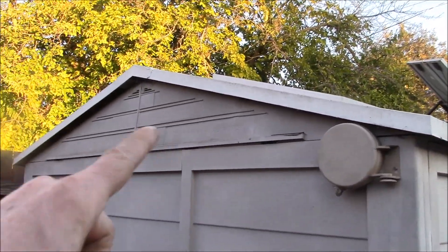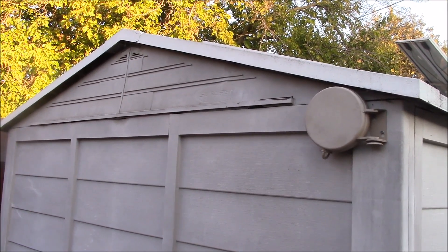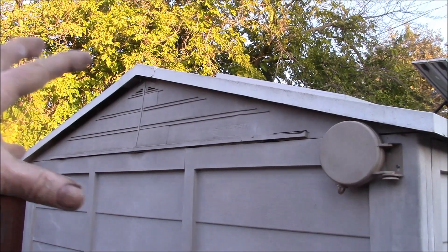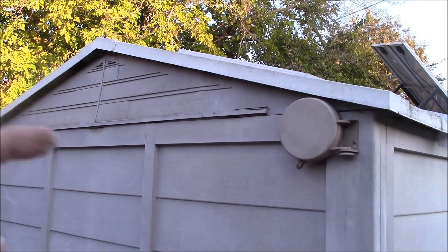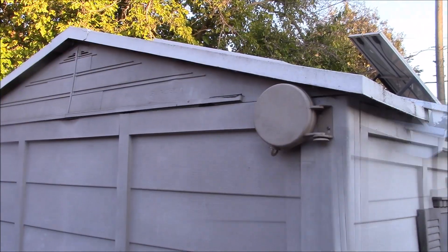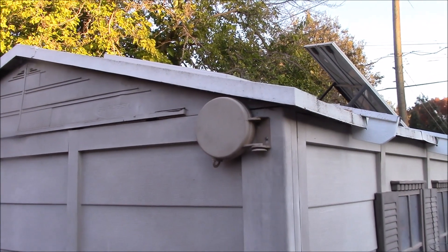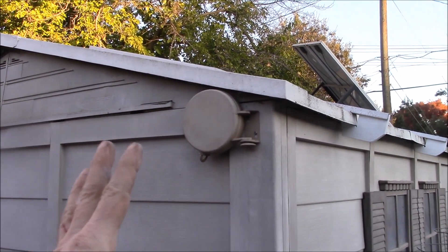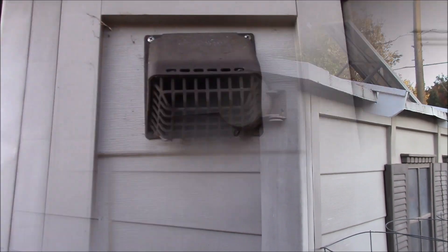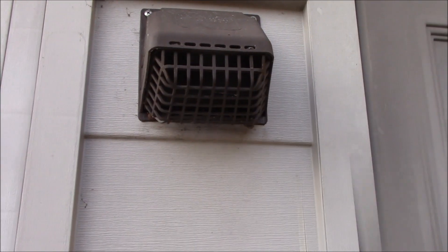These solar panels power the ventilation fans. On this end of the shed, right up at the peak of the roof, there are little openings along where the wall and roof structure join, and there are vents along there for air inlet on this side. I've got two fans on the other side blowing air out, so air basically comes in here and blows out the other side. In the afternoon we normally get a wind coming onto this side of the shed, so there's wind pressure on this side while the fans exhaust out the other side, keeping the natural airflow going.